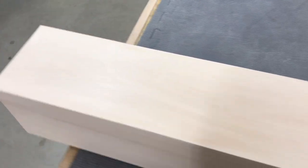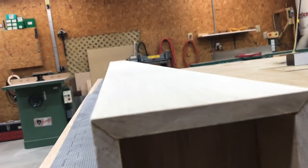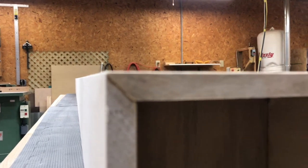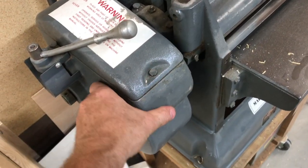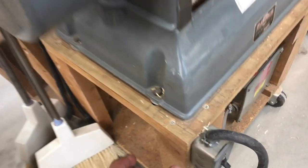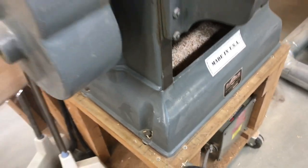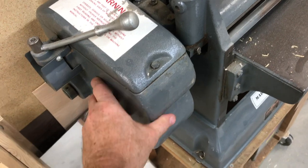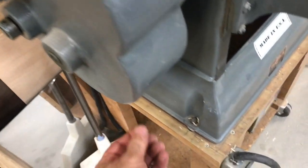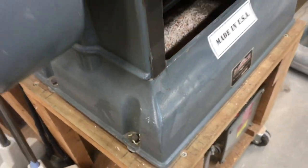Pattern shops all over the world have used this and still do — not nearly as much, because you can buy foam that is stable and straight. So if you ever looked at these old castings and said, how did they make them? The pattern makers of the day would have made these templates just a little larger, so when the metal cooled off it would be the right size. Then the parts that had to be really precise were milled off on milling machines or metal lathes.